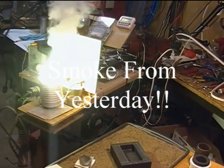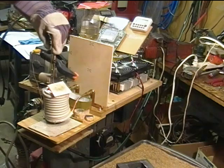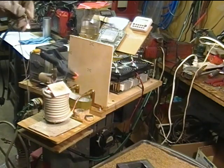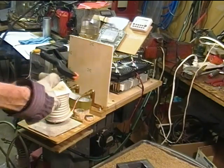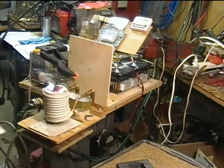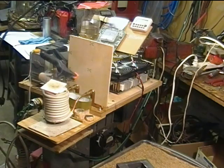That doesn't look good, does it? Nine hundred and fifty degrees Celsius. The iron is definitely starting to glow. We're back to 40 amps. Four minutes and forty seconds into the test. Twenty-nine degree water, 43.2 kilohertz. 980 Celsius — I think I'm going to take my thermocouple out. There's some of that burning zinc; I thought I'd gotten it all off, but it's nothing compared to yesterday, and I am blowing it away.